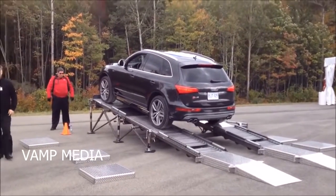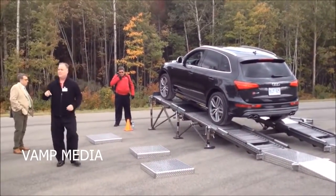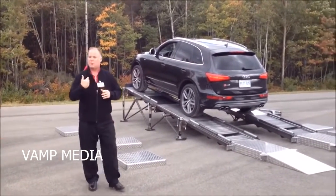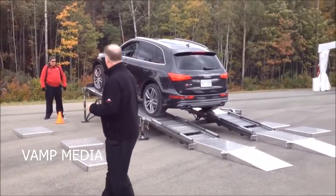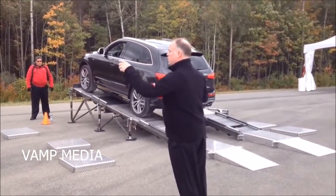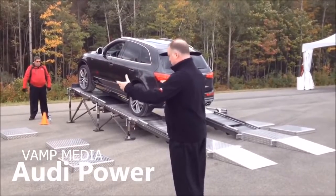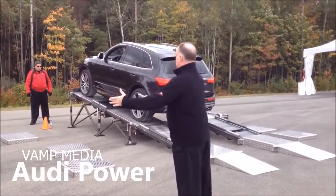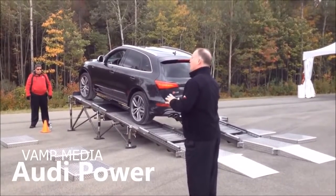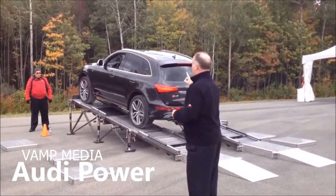One tire's got grip. Got a mechanical system that flushes out what's happening north-south, sends torque to the front. The front diff is open. We can get a little bit of wheel spin. We mitigate it by using EDL, the ABS traction control, and it sends the torque to the one tire that had not great, but okay traction, and it walked the vehicle up.